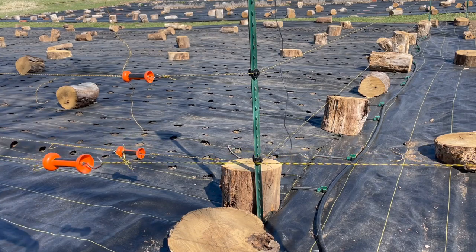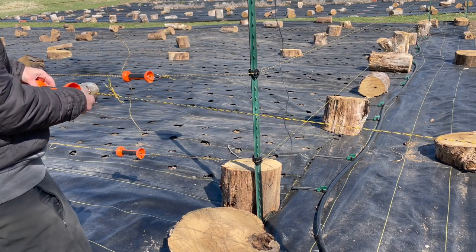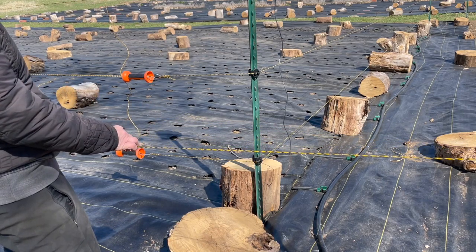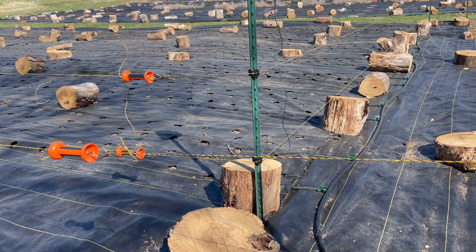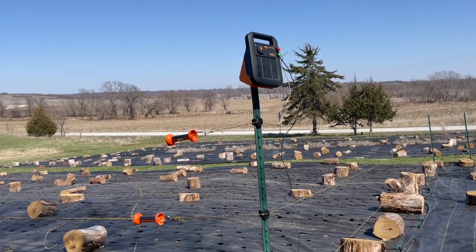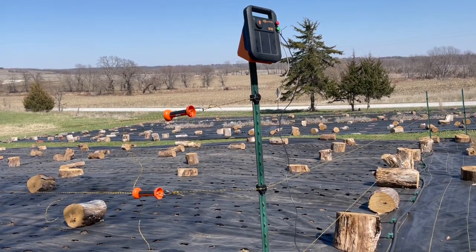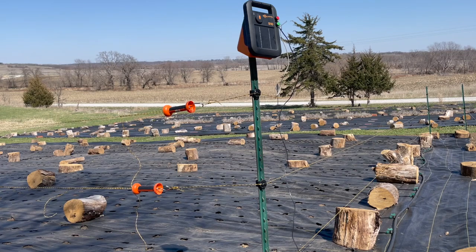I pull it tight. I'll want two handles at the gate so they can go together and I can grab both without getting shocked. I like to have my fence charger on the three inner lines so it's strongest there, then run a wire out to the outer fence. On the other lines I can turn it off and unhook them, but the outer one I honestly used to just duck under or climb over last year.